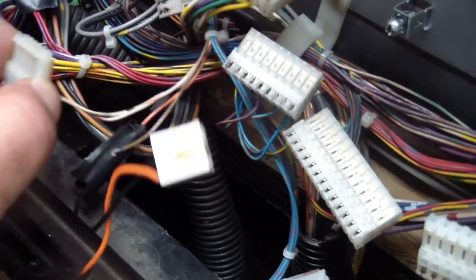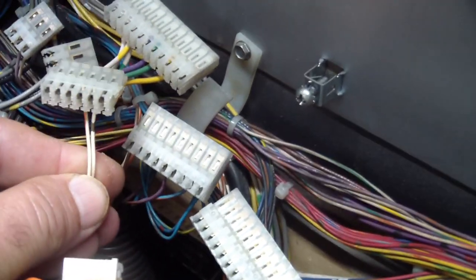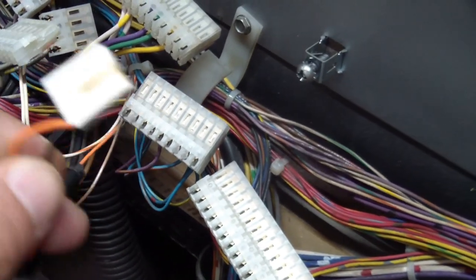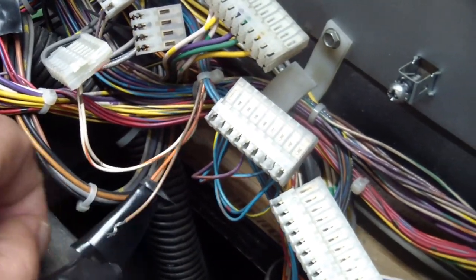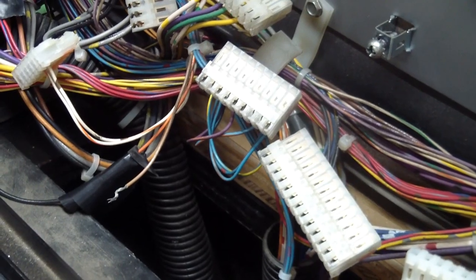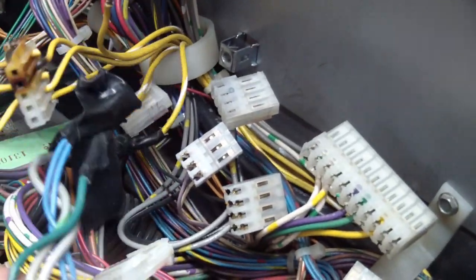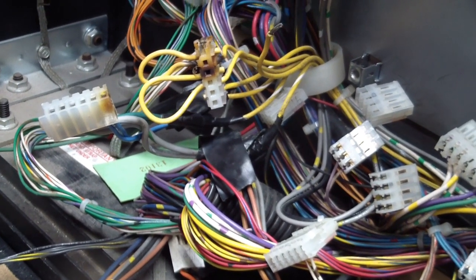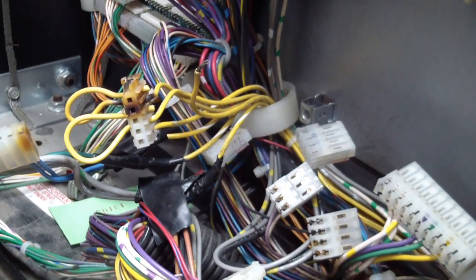Here's the other end of the story. This connector - the left side - still looks good. We only have four wires on this one. It's an 11-pin - the one where I just changed the two pins on the right side. This one still looks good, but it's four wires that go into that connector that are going to be redone. And then the real bad part, of course, is this thing over here, which also uses tape. I'm not going to trust any of this - the connections themselves. I'm going to go through the schematics and make sure that this gets hooked up correctly. One thing I already found is the wire colors listed in the schematic don't match this.